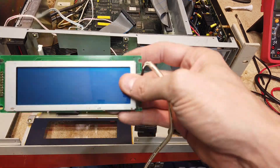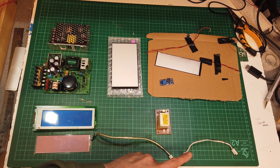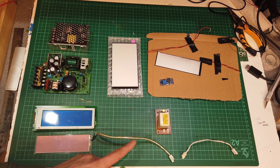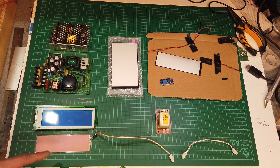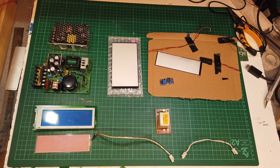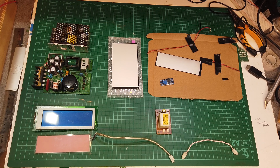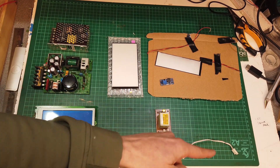Right, cutting a long story short. The backlight system works like this: a power cable takes 5 volts off the PCB and feeds it into the backlight inverter. The inverter steps that up to around 90 volts to drive the fluorescent backlight membrane. The membrane is old technology — you can still buy them — but the big problem is the backlight inverter is no longer available new. Old ones are on eBay but those are dying too, so I don't want to replace the membrane for £20–30 when the inverter is the known fault.